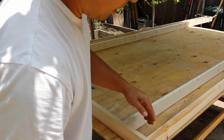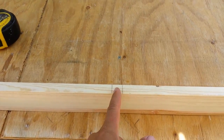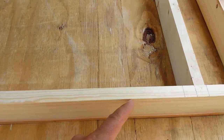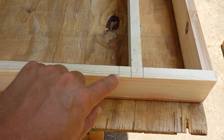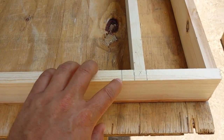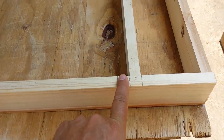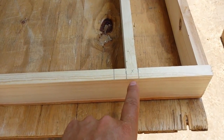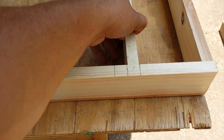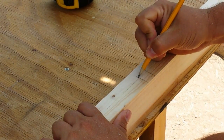Since I'm going to add a three-foot door, I started from the center of the rail and went each way, marking at three feet. Since I'm going to add a door frame that's a little deeper — like a one by six — it's going to sit right here, so when I frame the wall I'll go another three-quarters of an inch in, and that's where the stud is going to get nailed into place.